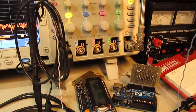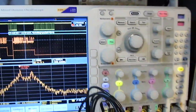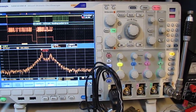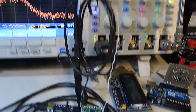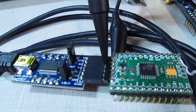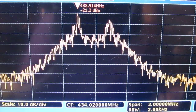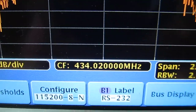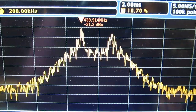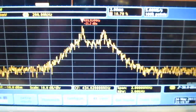It's just showing that there's wireless activity going on between these two nodes. I've got them hooked up to my Tektronix MDO 4000 mixed domain oscilloscope, with RF signals coming into the antenna and channel 1 probing the RS-232 line on the interface. Down at the bottom is the spectrum of the signal, centered right at 434.02 MHz, with a 2 MHz span. The two peaks indicate binary FSK modulation, which is what this thing uses.